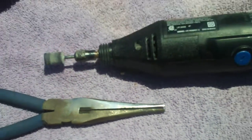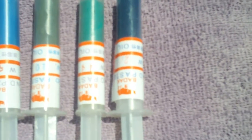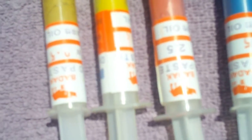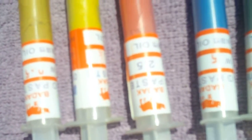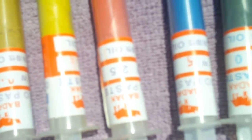The before and after — but what you want to do basically is just run this in a series of grits, starting with like say 20, 10, 2.5, 1, and then a final buffing polish would be 0.5, which is 15,000 grit. These basically run starting out at about 300 grit on up to 15,000.